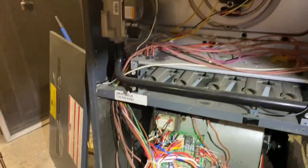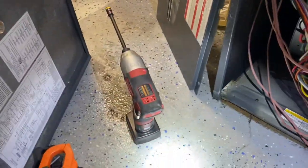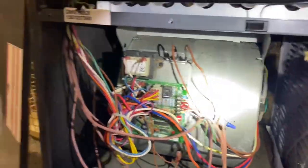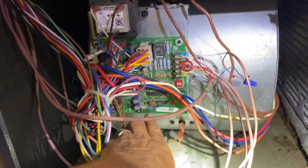Okay, power is on. Good. What was wrong with the outdoor unit? It was really dirty and the capacitor — I tested it — it was bad. Okay. And how about the capacitor for the indoor blower? I tested it too. See the corrosion right there? Yeah, on the control board?